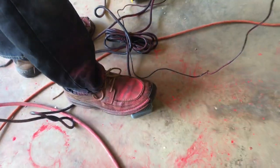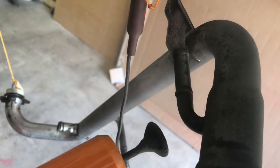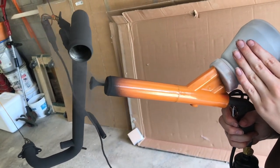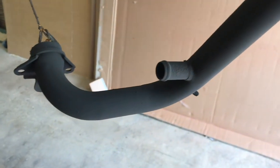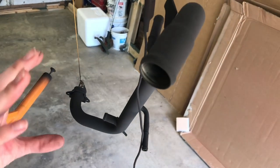Now we'll turn on the machine and we can use this foot pedal to energize the part. This tapping method really seems to loosen up the powder and does a great job at getting it evenly spread out — it's helping a lot. The corners in there can be a little bit tough just because of the way the static electricity almost repels it sometimes. So you have to just add a little bit more. But this is looking really good.